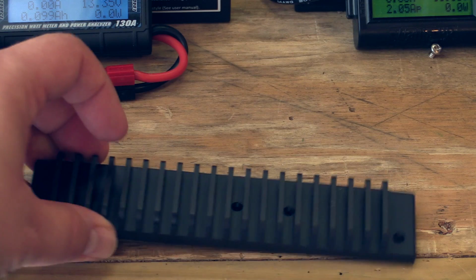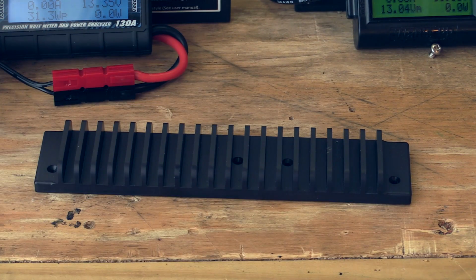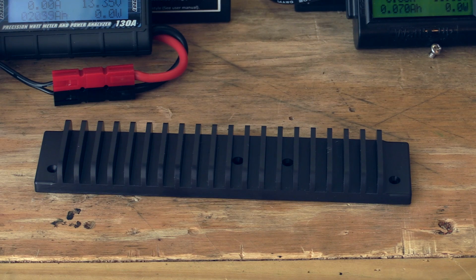Now, one thing to point out is in the package they include the mounting screws as well as a small container of thermal paste. It's important to use their screws because this metal is thicker than the stock heatsink that comes with the KX3. The longest screw that's included is used to go into the radio and pass through the roofing filter assembly into what it screws into. So it's different than the other 3 screws in the package.